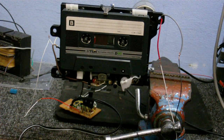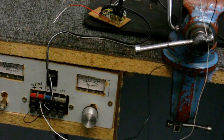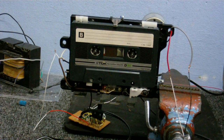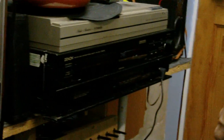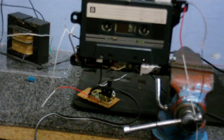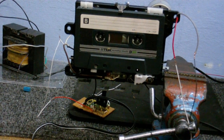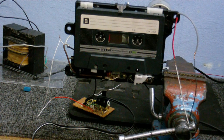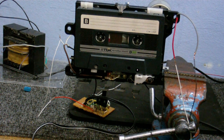Okay, it's time for another experiment now. This time I have disconnected the capacitor from the head, so the head is now getting the pulse DC from my little function generator. I've lowered the power supply down to 6 volts, so hopefully nothing should get damaged. I'll start that recording — I've rewound the tape back to the beginning — and I'll start this cassette tape player. I have no idea if it's making a recording or anything, but we'll see.